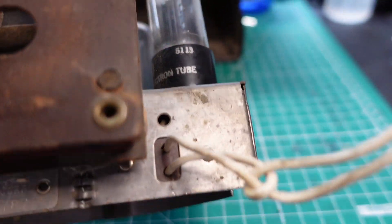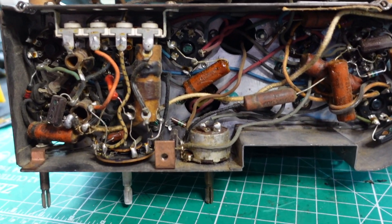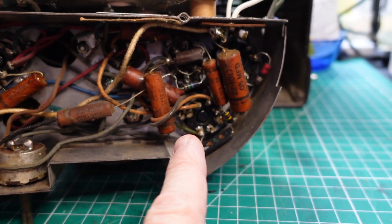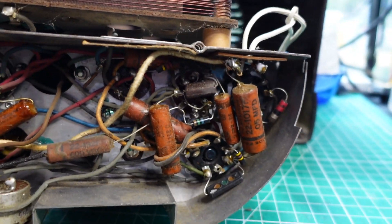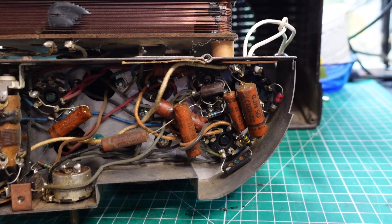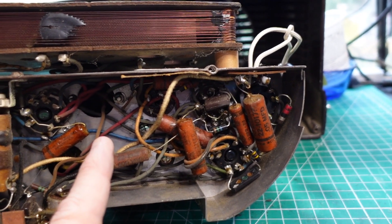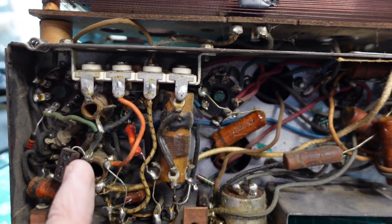Let's take a look on the bottom and see what we got. Okay, so here's our bottom. We got the typical wax caps, which is good. I don't think there's any evidence of anyone being in here before, which is good because I don't see filter caps tacked under here. So that tells me the filter capacitor that's up there is probably original, and that's good. The only problem is replacing all these caps is going to be a real pain because of this wire — we don't want to disturb this wire. There's several ways we can deal with that: we can put liquid tape on them, we can put crazy glue on them that will hold them together. I have to take a look at it and decide how I'm going to handle it. But the things I'm most concerned about are the IF cans. That's where the big problem comes in — if those things start to brittle and start cracking, I'm going to need to remove the cans and rewire them. But you can see when we get down into this section, it's really, really crammed in there, so we want to try to avoid that if we can.